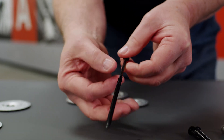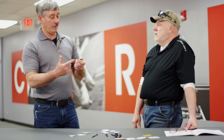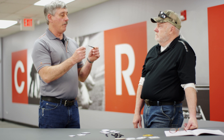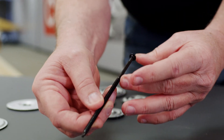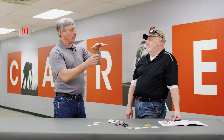We sell certain lengths — shorter and longer. The longest screw is around 14 or 15 inches. After two inches, we don't make half sizes, so you go two inch, three inch, four inch, five inch. Any size screw — whether it's four inch or ten inch — only has four inches of thread; the rest is shank. That's very important depending on how much insulation you're going through, and where the fastener actually has to be placed. If the screw goes past the thread into the shank, nothing is holding it.